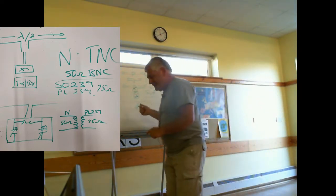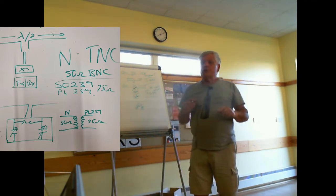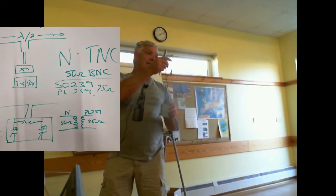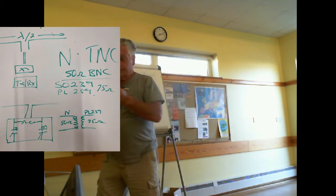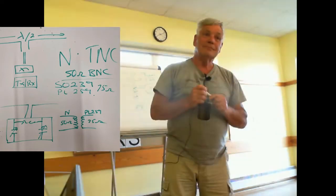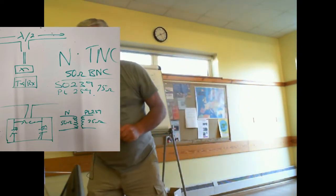Yeah, I know that. So that then, Chris, that's the reason why on professional signal generators and whatever, like the Marconi I've got, it's an N connector. It will be an N-type connector. That's why on there you've got, if you like, SMAs. Yeah. These SMAs are true 50 ohm connectors. Chris, what about if you're saying N connector? What if you put an N connector to a PL259? What would that do? Cock it up.